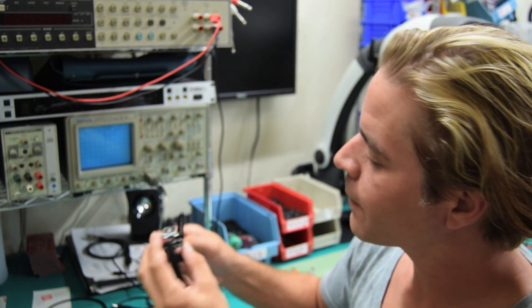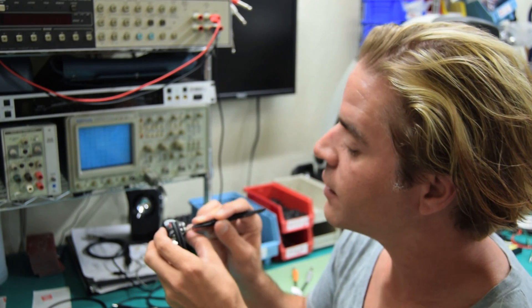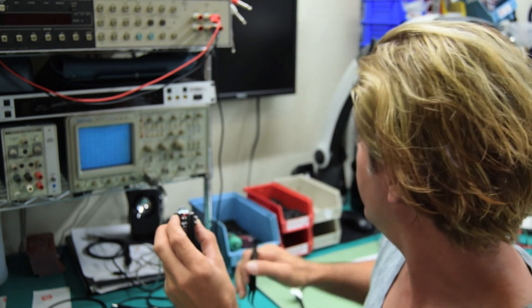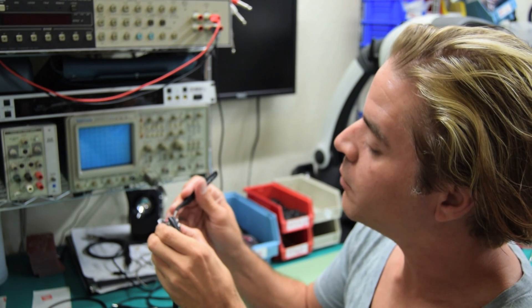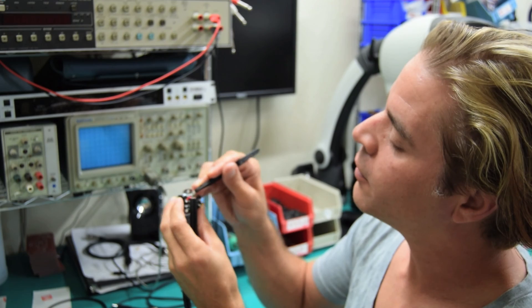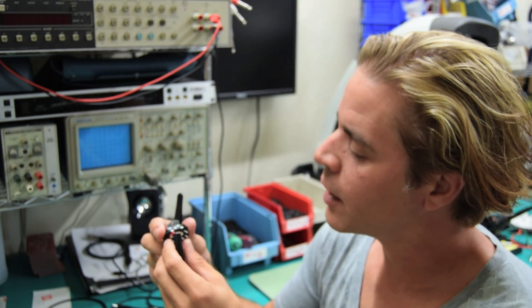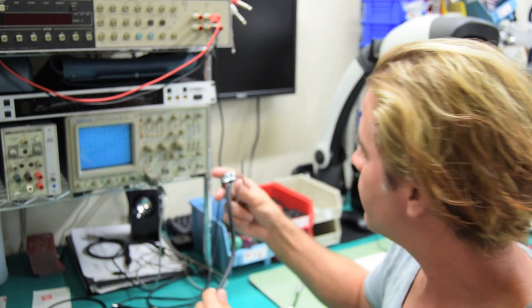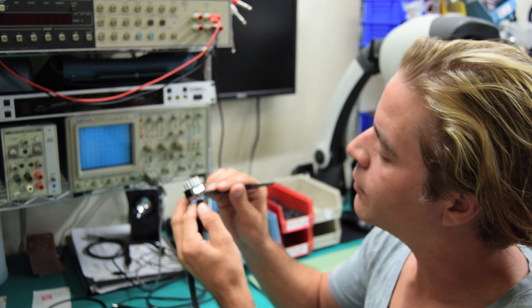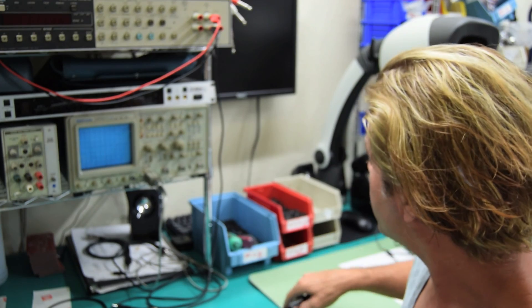The solder pins are labeled one through eight. The tip or signal of our cable goes to pin five. Next to that, on pin three, is where our ground or shield goes — from our quarter inch or eighth inch cable, whichever you decide to use. No additional circuits are needed. Just make sure when you solder that you don't have any shorts or melted insulation around your wiring. That's pretty simple — this controls the gate portion of your EMS synthesizer.